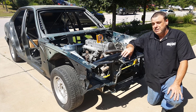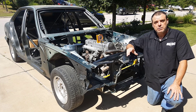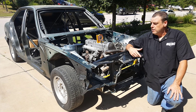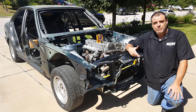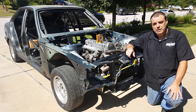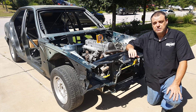This mount will be done a little bit differently than the Mercedes. I have a lot of roll cage tubing left over so I'm going to utilize that — very thick wall DOM tubing, one and three quarter inches. It's a little bit overkill for this but it will still be a very strong mount. On the Mercedes I used one-by-three rectangular tubing, and since I didn't have a bender for that I had to cut it with a grinder and weld it up at each joint. Similar process, different materials.